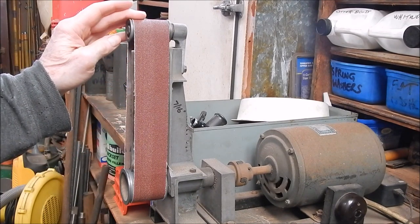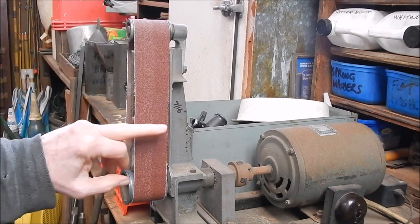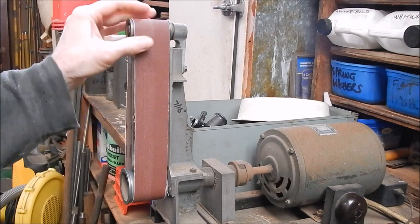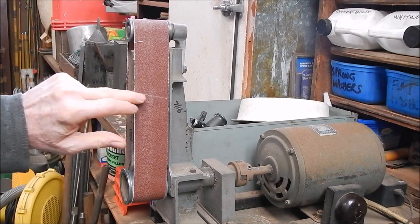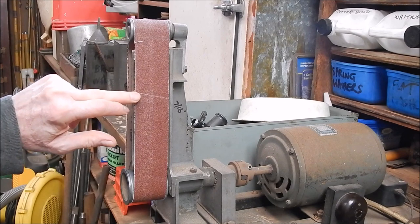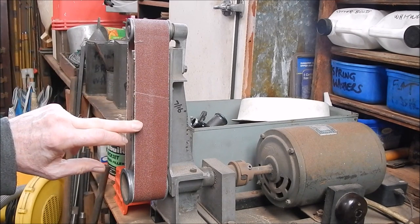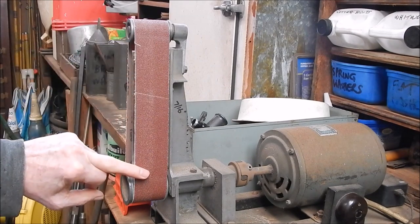The thing with them, though, is that the belts get a bit of a beating. I go through belts fairly frequently, and what happens is they normally come apart at the join, where they sort of overlap. You can see the speed that goes at — there's the join. And you can see they overlap them, and the glue seems to deteriorate with age. I bought a whole swag of them a couple of years ago, been in storage, and they've been coming apart very frequently. You only get about ten hours use out of them if you're lucky, and then they'll fly apart — less even.